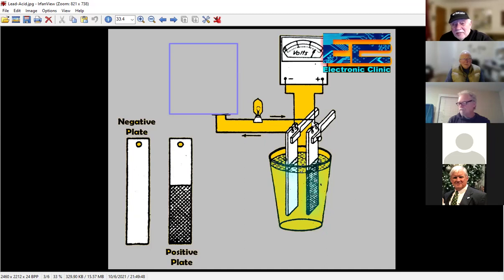And as the electrons flow between them, they can start doing work. In that other diagram, we showed the wire going through a light bulb, causing the light bulb to light and back. It is a circuit. Now, what happens if the light bulb burns out, or someone pulls the light bulb out? That is called an open circuit, and there will be no electrons flowing. What if somebody puts a wire around the light bulb socket so it's a continuous wire? That's called a short circuit and will cause the maximum amount of electrons to flow. It's called a current flow.